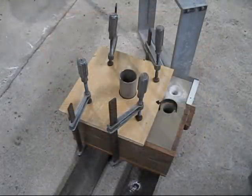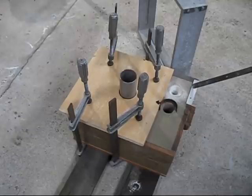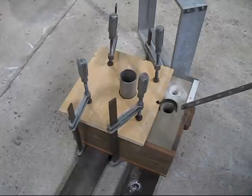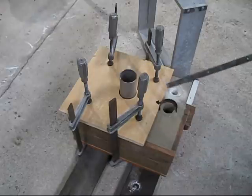So the mould's ready to go, and we'll point out a few things. Number one, I've put a bit of a heat shield. In the past, the box has burned too much, so hopefully that will correct that. This is for when you aim the crucible with a trolley. It's very hard to aim, but if you do splash a little bit, I've got a little guard there and there, so if it does splash, you won't fall into the riser or into that riser.